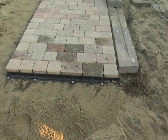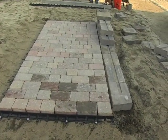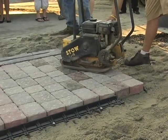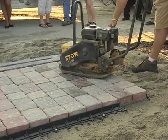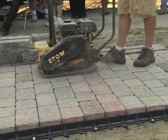Once our pavers are in and our edging is placed, we are very close to our new patio. Finished beauty is close at hand. We still need to settle our pavers into the sand, and we are going to achieve that by bringing back the compactor. Sweep the pavers clean, then bring on the compactor.